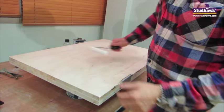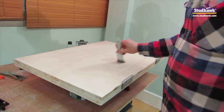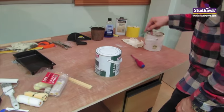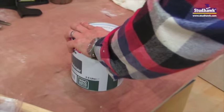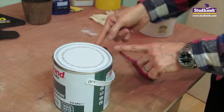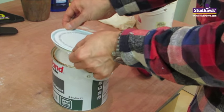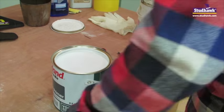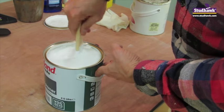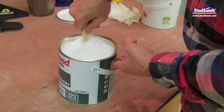The one we're going to use for oil-based paints is the mohair roller. We're going to roller this and then brush out, laying off with one stroke as we go. Let's open our paint. Don't try and force it. Use your paint knife a little bit going around the rim like so — it stops your lid rim getting torn. Give it a shake, and now give it a stir because at the bottom you get all that pigment you want mixed into your paint.